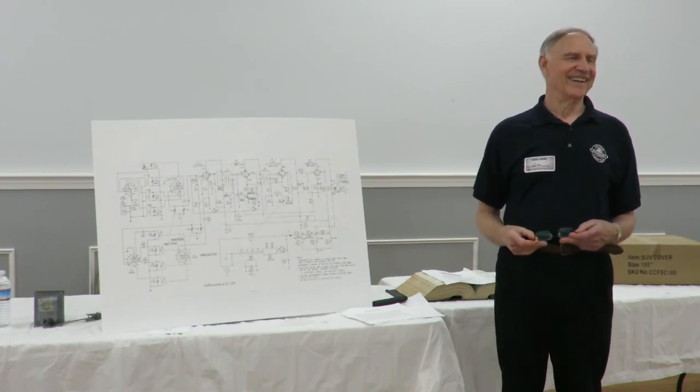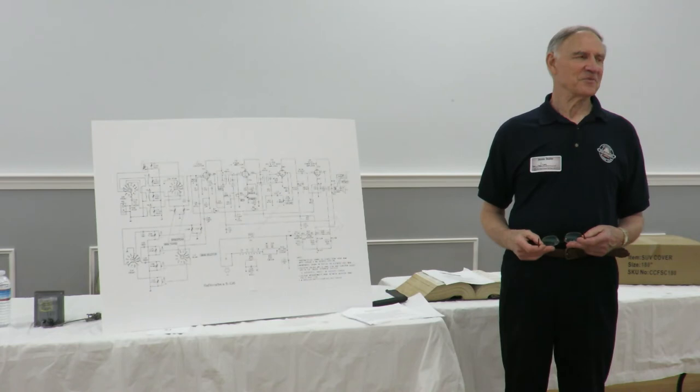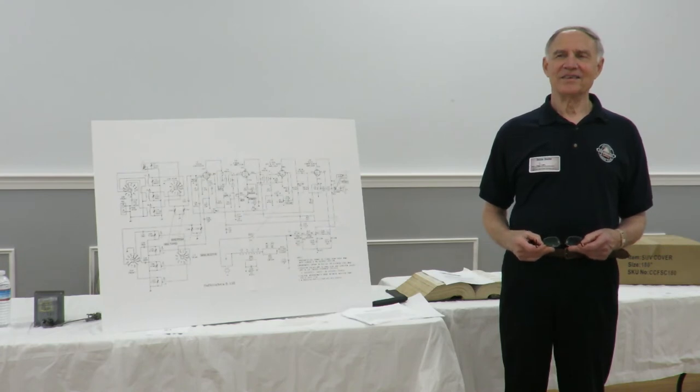If it does it on all the bands, the first thing I would think of, not that it has to be this, is the variable capacitor shorting out in that particular part of the band where you hear nothing. But it's more like it performs normal, what I would consider normal. Oh, normal. And then outside that, it's just noisy. Loud. Just static. Loud. Okay.